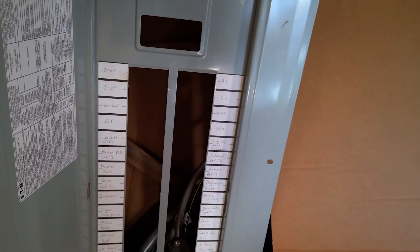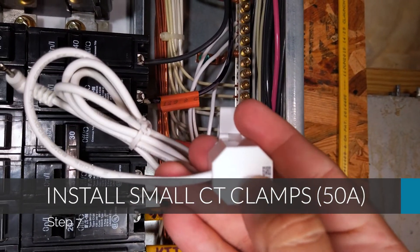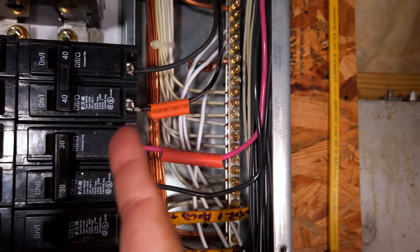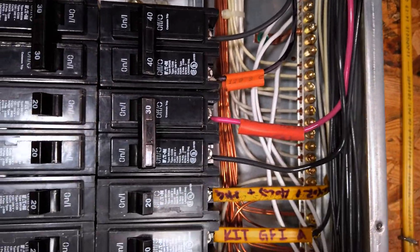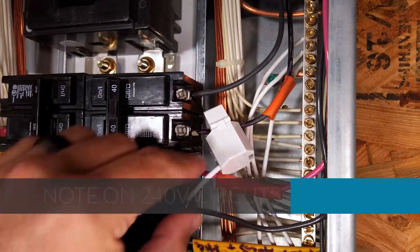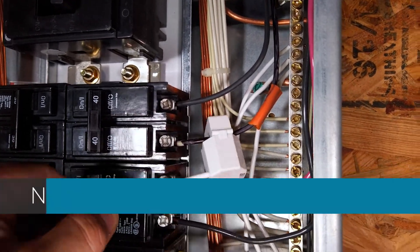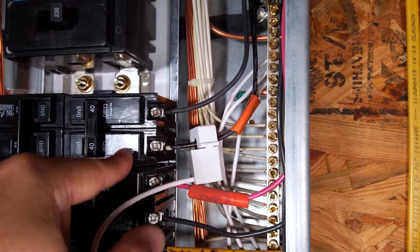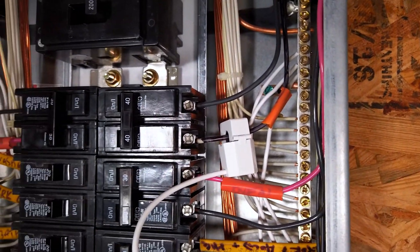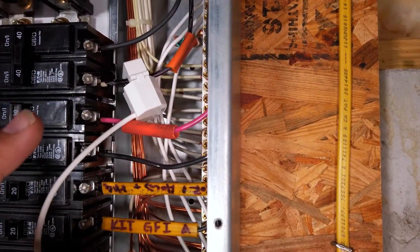It's always a good idea to keep the panel diagram close by so you can refer to which circuit is which room in your house. When connecting the smaller CTs, we want to make sure that the L points towards the load and the K points towards the breaker, so in this case the cord will always be to the left. Quick note about multi-phase: if you want to interconnect with one of these multiple-phase breakers, the instructions say just attach one CT to one leg, and then you can multiply those in the application. I'm going to attach this one to my air conditioner.